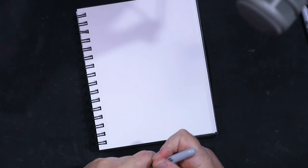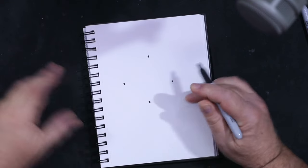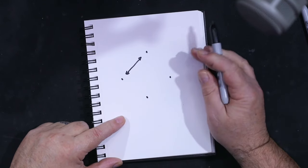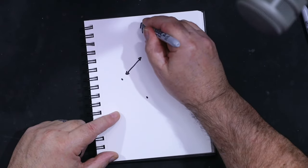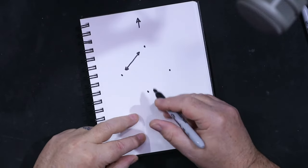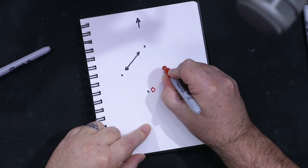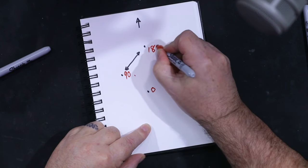I'm going to put dots here — this is a four-square. Imagine looking down from a helicopter at these four antennas. I believe the distance between them is probably about a quarter wavelength. There are four bits of coax from some sort of control box, and the phase angles are: one has zero degrees, two have 90 degrees, and one has 180 degrees. That's fundamentally a four-square.